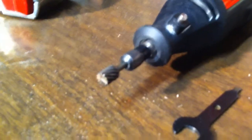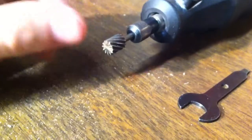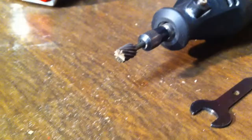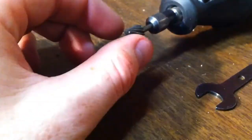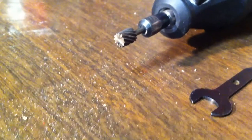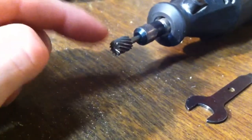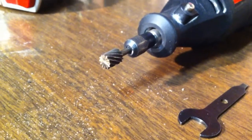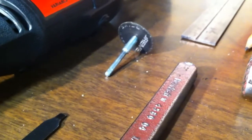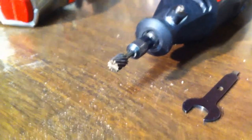After that, I cut with a side-cutting Dremel. As you can see, it's cut at a nice swirl shape and it has a nice edge so you can actually plunge cut down into the metal. This size is the perfect size bit — I believe it's a quarter inch from edge to edge in diameter — so you can plunge down into any excess metal and round out your nice slot shape. Make sure to wear gloves; I got a few micro splinters of metal in my hands from this tool. It puts out very fine, shard-shaped pieces of metal, unlike a fiber cutting disc which puts off little balls of metal that don't cut into your skin as much. Wear eye protection, use a shop vac once you're done, wear gloves — safety first.